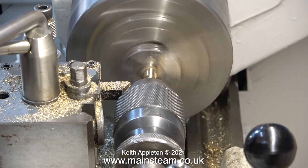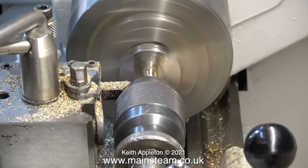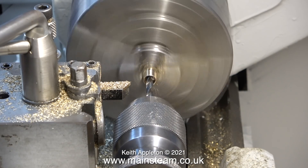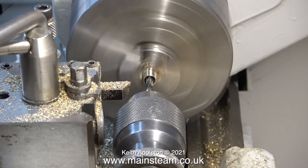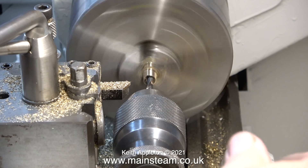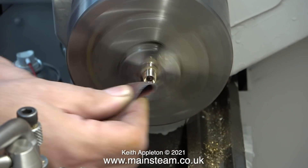It's quite important to drill all the way through, because if you don't it's not going to be a very successful fitting. I'm really not being condescending — I've done this many times and forgot to drill the hole all the way through the center; it's really easy to do. It is also very important not to drill too big a hole in the center of the fitting because it will weaken it. A hole of three sixteenths of an inch in diameter should be fine, because that's the internal diameter of a piece of quarter inch copper pipe.